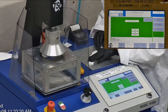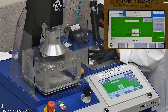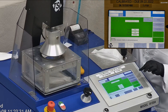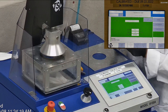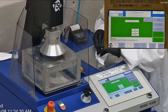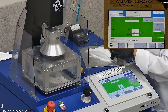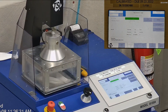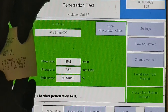The first sample tested at 99.63% filtration efficiency with a pressure drop of 8.6 millimeters of water. The second sample had a filtration percentage of 99.74% and a pressure drop of 8.6 millimeters of water. The last sample had a filtration percentage of 99.55% and a pressure drop of 7.6 millimeters of water.